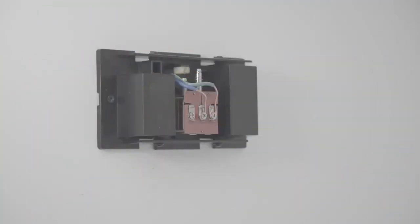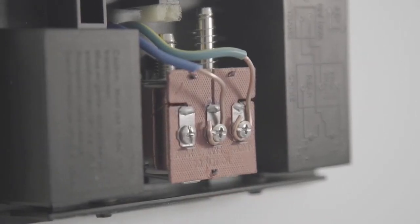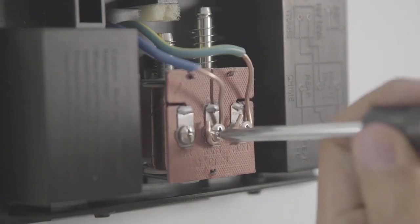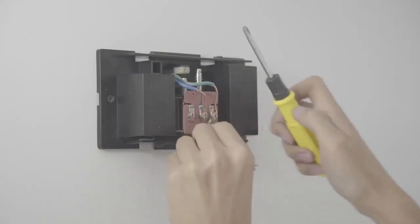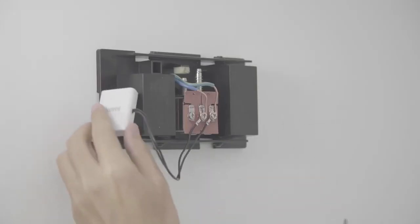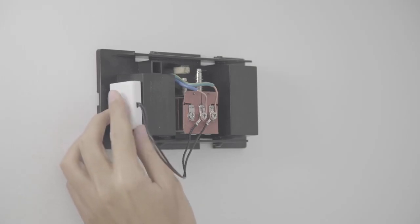On your internal doorbell chime, locate the 2 wires. If there are more than 2, look for the label front and transformer or trans. Loosen the screws on both wires, but do not detach entirely. Gently slide the 2 wires on the Cami chime connector and retighten the screws. Mount the chime connector inside the mechanical chime to hide it and place back the cover.